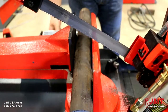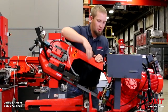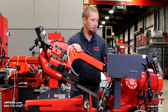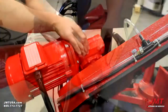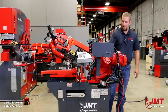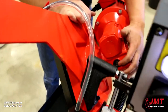It comes down with the roller guide. That's a cast iron frame — it's actually sitting on an angle a little bit, which doesn't put as much twist on our bandsaw blades. It's another benefit to blade life. Cast iron is very strong and rigid; you don't have vibration through cast iron like you would with a tubing frame saw. You can see here we have a motor that goes right into a gearbox — we call this direct drive. It's got variable speed to adjust our speed inside the motor. It's very strong — it's to a gear, not through a belt. A belt can slip, and if it does slip, you're going to tear your teeth out. You've got an oil bath, and you can actually see the oil level of our gearbox.